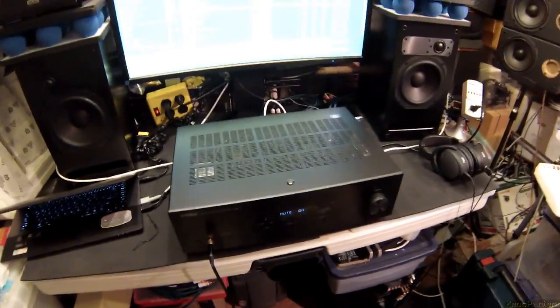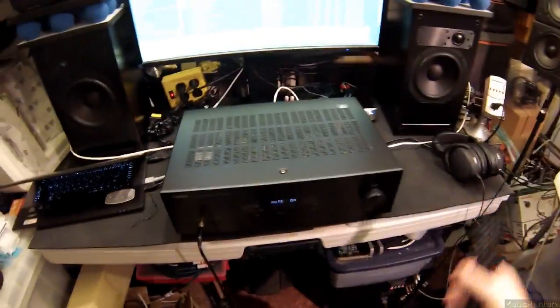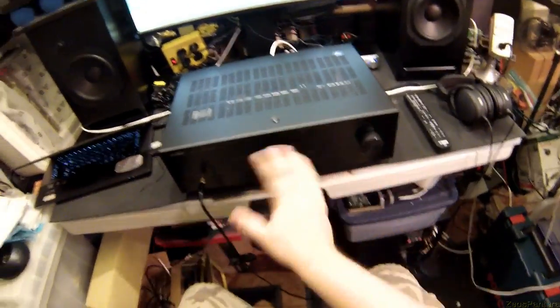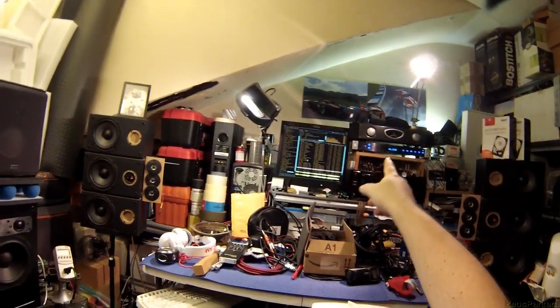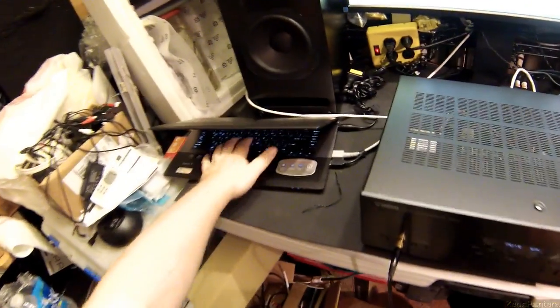If it can do 100 watts per channel and it actually hits that, then it's going to suck 100 watts per channel out of the wall. So you'll have a 200 watt electric bill, which you'll never get to. If you have this at maximum and you're listening to it and it's okay, you probably need a bigger amplifier, bigger than this. You start looking at the A500, which is actually only about 125 watts at 8 ohm, but then can bridge mono into 500. That one's stupid. Look at the video of that one. Good, Richard Cheese, I can't play anyway.